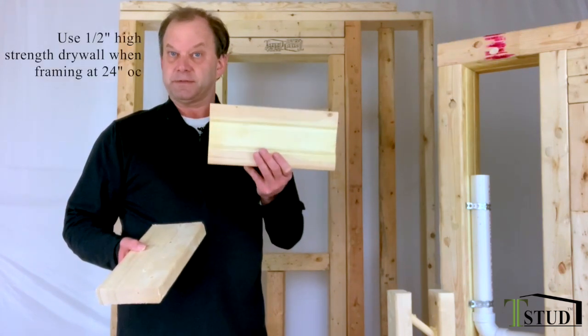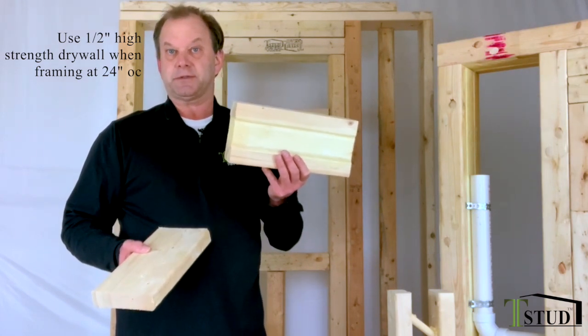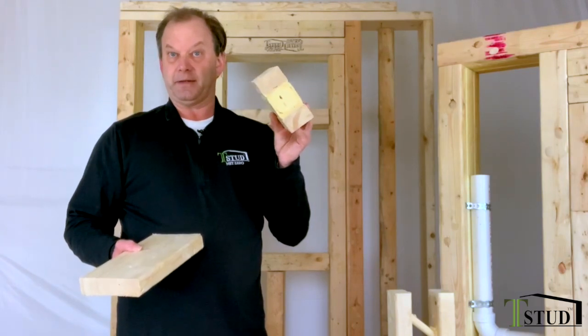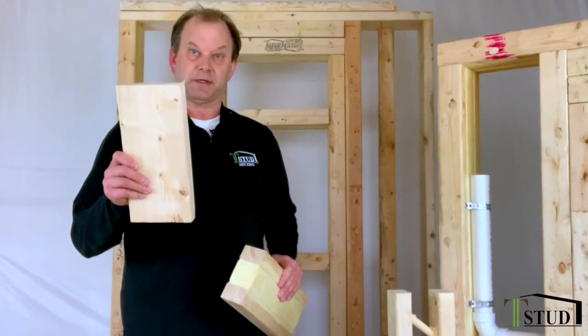Every structure we've done so far is at 24 inches on center, except for one shear wall in Colorado — 12 feet tall — where we ended up at 12 inches on center. We've done pretty good value-added going 24 inches on center. These crush at 3,600 pounds.